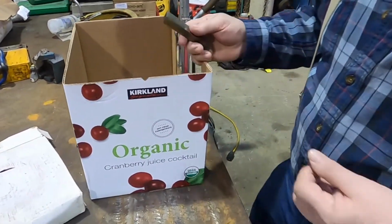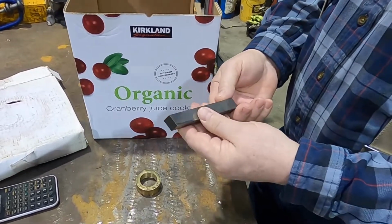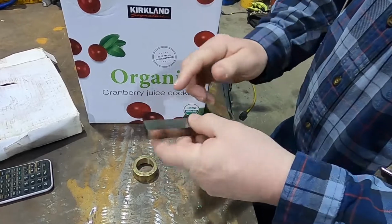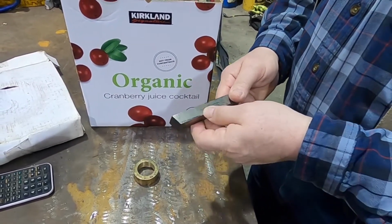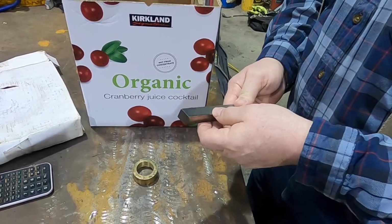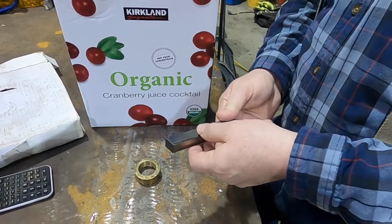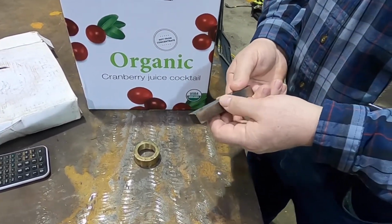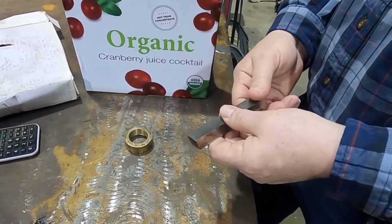Cool. So if we start out here, our basic old style tools would be high-speed steel, when they come like this. They're just angled on two sides. You'll see in some things, especially old Sears catalogs, where you can buy left-hand turning, right-hand turning, finishing tools, all this. And I got excited about those when I was a young man because, wow, these are cool. You can buy all this stuff and you don't have to grind them.